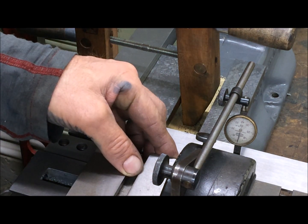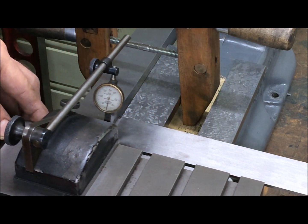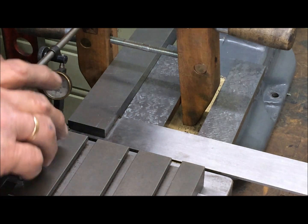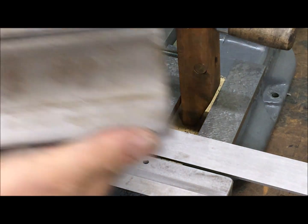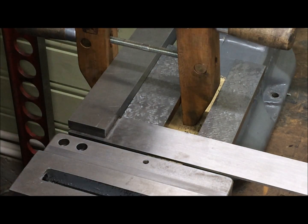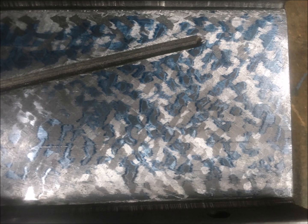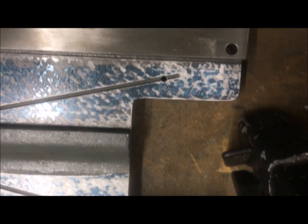This is pretty darn flat, I'd say. Nothing to do, just scrape and mark out the bottom of the cross slide a little bit. But this is also virtually virgin, so a very nice example. It has enough points now, so we can move on.